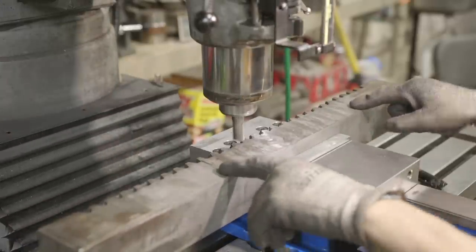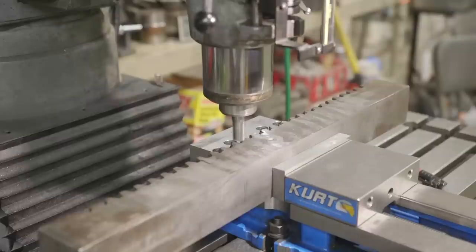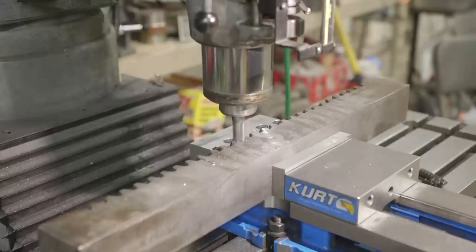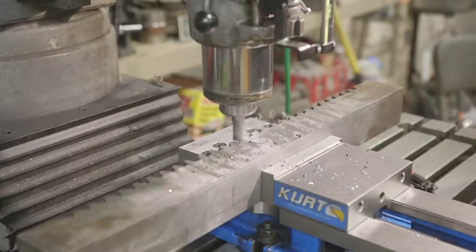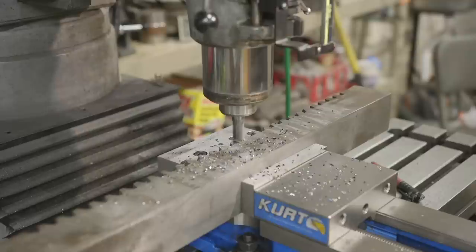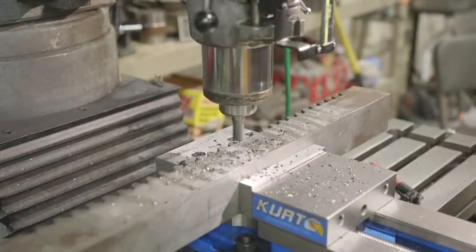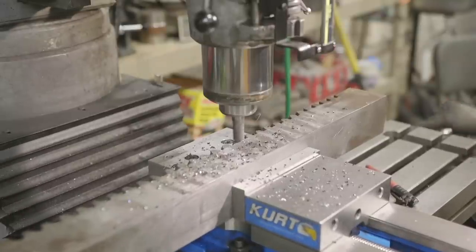I've got my ends marked. We're just gonna mill in here just to try to remove some of this old material. I got a carbide 5/8 end mill in here. We'll see, hopefully it doesn't get too upset at me. Put a little bit of tension on the table to kind of keep it from jerking. Up the RPM. There we go. A little less chatter. Running 800 RPM.